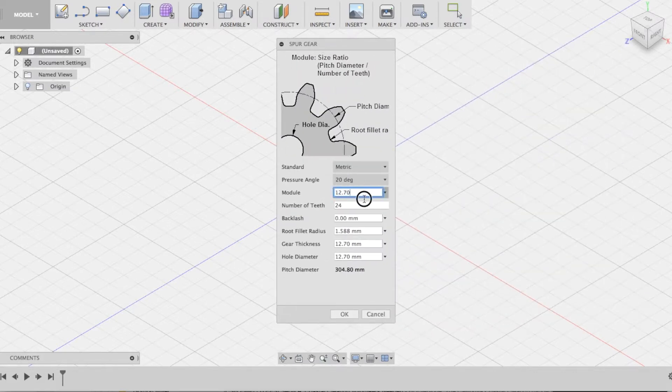This menu has a lot of choices. The principal thing to determine the size of the overall gear is the module. We're going to be picking a very small module number of 0.7. When you do that, you're going to see some errors down at the bottom, so we're going to make adjustments to some of these measurements to fix those errors in order to have a gear that's going to print successfully. Take careful note of all the measurements that we put in here and feel free to follow along in Fusion 360 and copy these same values.